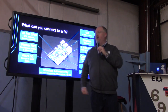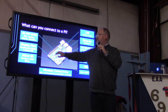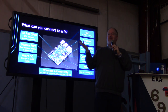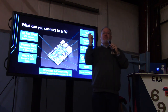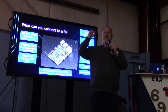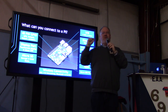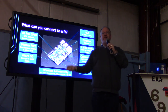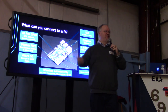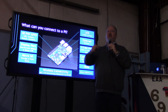The display port on the Pi interfaces with the Raspberry Pi Foundation's 7-inch touchscreen. All storage on these Pis is solid state — they take micro SD cards, the same little ones that go in your phone or new cameras. They're relatively inexpensive. A top tip: if you're going to make multiple projects, buy a bunch of the same size cards from the same company at one time. An 8-gig Micro Center brand card and an 8-gig SanDisk card are not exactly the same size, and you'll always end up with the smaller one when starting a new project. So make it easy on yourself — stick with the same brand and size.